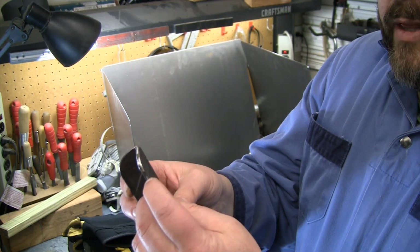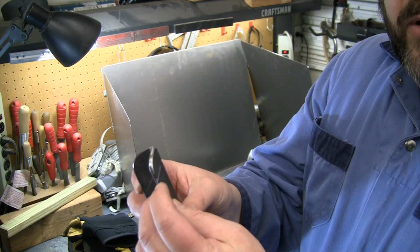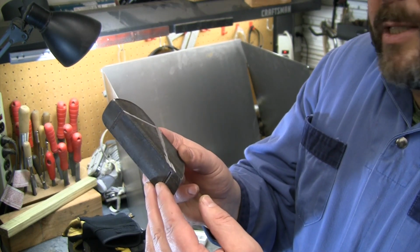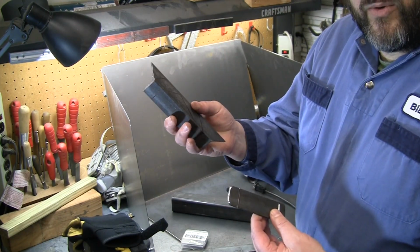Just the hacksaw width, a little bit of extra rubbing around in there with the hacksaw, and that's just about the perfect width for that 20 gauge plate to fit in there. So we got those cleaned up. So I got one of these done. I'll get a close up here and I'll show you what this looks like actually in place. And then I've sort of marked out the other one, and we'll go through and hacksaw that out.